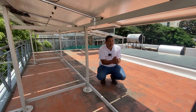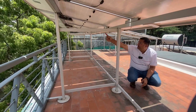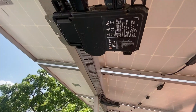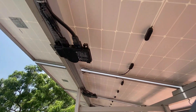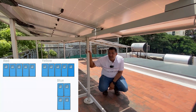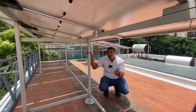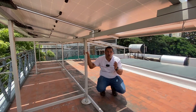This particular project has 22 panels. On this side we have all the micro-inverters — these are IQ7A series micro-inverters. In total we have 14 inverters, each connected to a 450 watt peak panel. These 14 inverters are divided into three phases: red and yellow have 5 micro-inverters each and blue has 4, totaling 14 inverters and 6.3 kilowatt for the on-grid component.